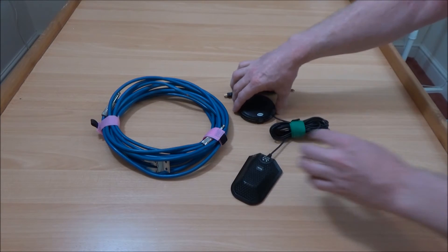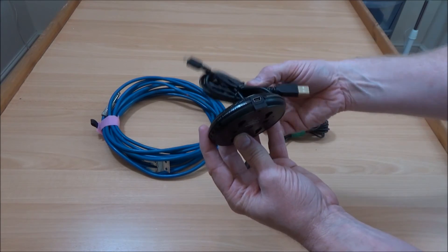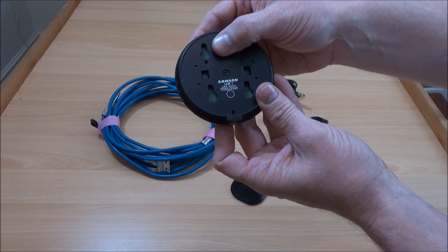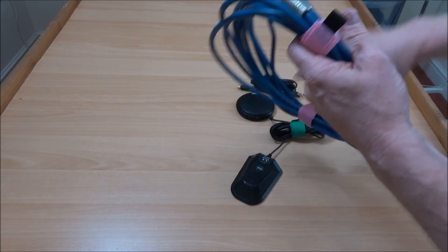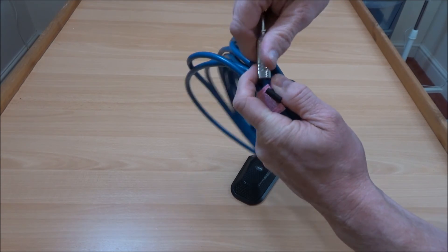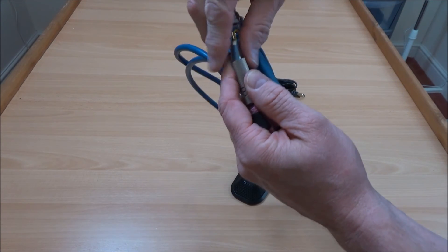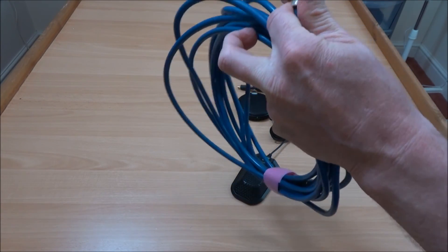We also have another little boundary mic — this is a Samson boundary mic, and it's a USB boundary mic. It's quite easy to get into; just a single screw in the middle. And then we have these — I've got quite a few of these, but I've just brought the one. They are audio leads — mono leads for a PA amp. What happens with these is they corrode and through movement, being pulled in and pushed out, the connections dry out, crack, or break, and they need to be all cut and re-soldered. So I've got about four of those I need to do.